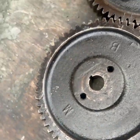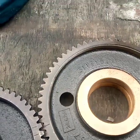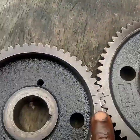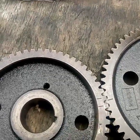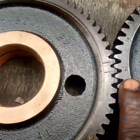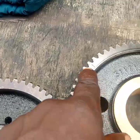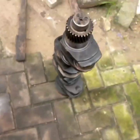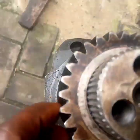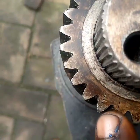This injection gear has a keyway. That means you don't need to turn your injection pump to number one before slotting it in. Since it has a keyway, and your injection pump shaft also has a key, just slot the injection pump so that its key matches the keyway of the gear. Then the injection pump will be at the correct setting, since your timing marks are already set.